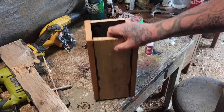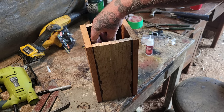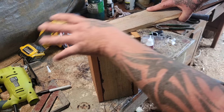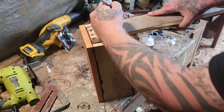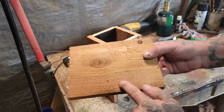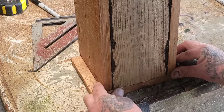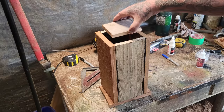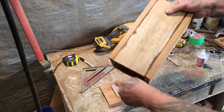The top — you need to make it so, pretend this is the top here: you need to cut out a little square bit that will fit inside here, because you want to be able to put the light in through the top. If you've got a little square bit that fits inside there and locks it on, this will be inside and then you'll make a top and it won't be able to blow off. It just kind of locks the top in place. So this is just a crappy piece of wood — all I'm going to do is cut it and show you how. So this is the top piece I cut. There are overhangs on each side. I'm going to put this inside here, put some glue on it, hold it down, and make sure this piece sits on top — it will act like a locking thing so your top won't be able to fall off.